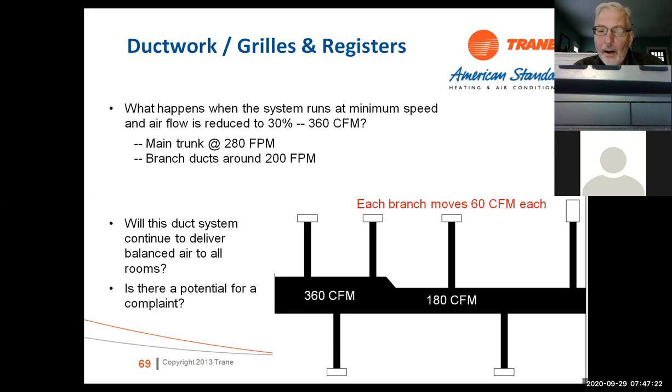In a case down south, they have a problem with the heating, okay? So in the attic duct system, they can't get the heat down to the floor because the air gets kind of lazy. It doesn't force it down. So again, remember that if you're using variable speed equipment, there are some airflow considerations you need to take into account. Now, if you put this on a zone system, that pretty much corrects it because if only one zone is calling and you're modulating down on low speed, it's probably the best scenario you can think of. It's going to work probably pretty good. So on zoning, it's a good application.